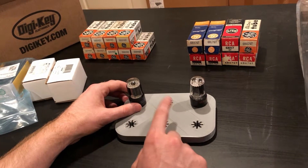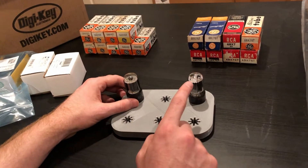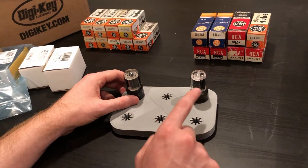Their performance is exactly what we want for high voltage, really wide signal swing, and high transconductance — especially for this driver. So we should have, with this configuration, enough gain, enough signal swing with our gain tube, and enough drive strength for our 845s with the 6BX7.